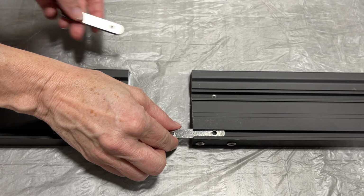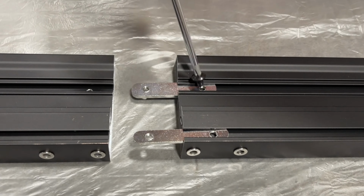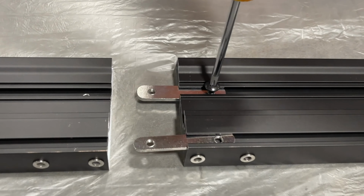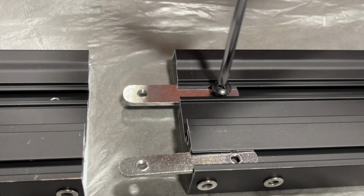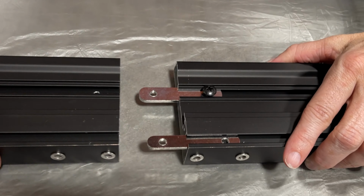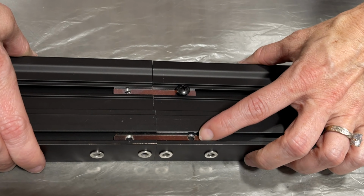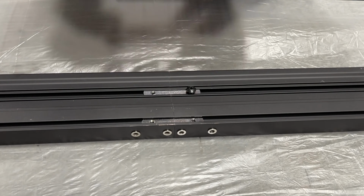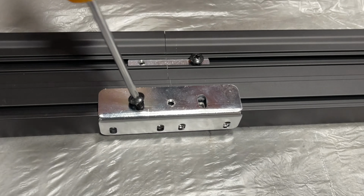Use 2 of the 2-hole nuts to connect the split frame pieces. Use one of the provided screws to secure one of the 2-hole nuts. Push the 2 frame pieces together. Use a retainer plate and 2 screws to lightly join the frame pieces together.